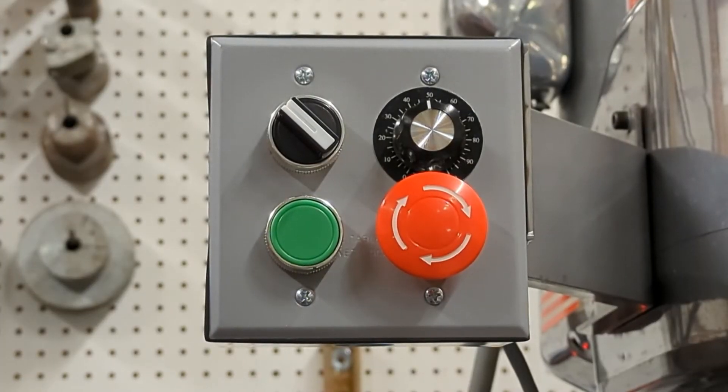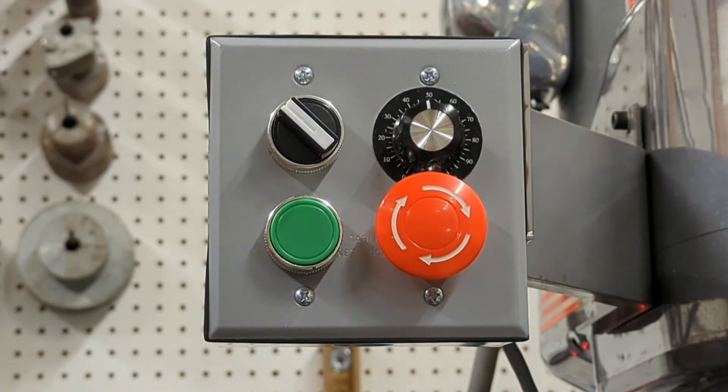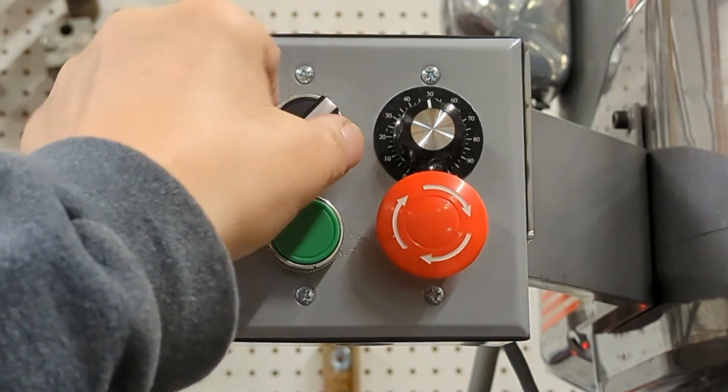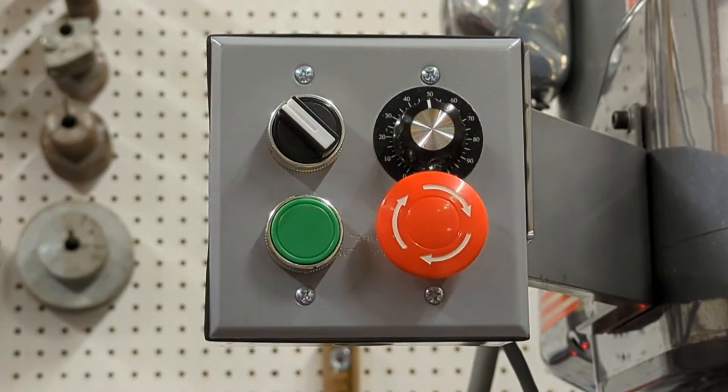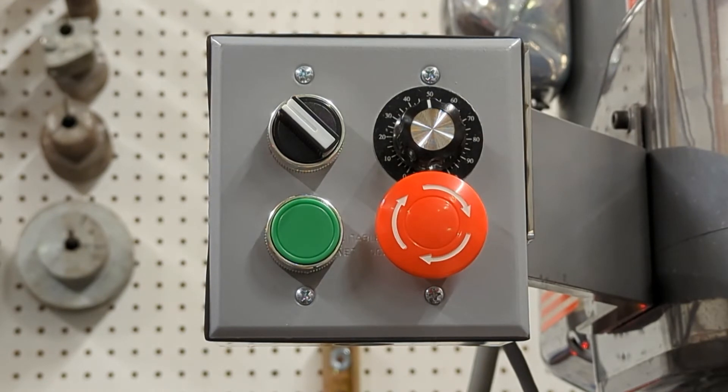To make sure everything's safe, I went ahead and built an e-stop switch assembly. Here's the e-stop, and here's the momentary-on to turn the contactor on so the motor can run. There are times when I'll want to run this in manual mode — not using the computer to make the cut — so I put a forward and reverse switch in here plus a manual speed controller. The Acorn CNC 12 software does give me all that functionality electronically, but I wanted everything mechanical as well. The e-stops are wired in-line, so pushing this e-stop or using the electronic e-stop both shut everything down, and I can still run it manually if I want.